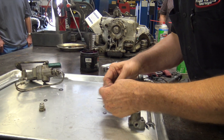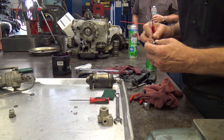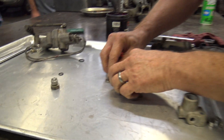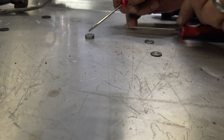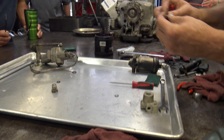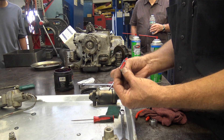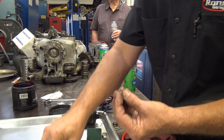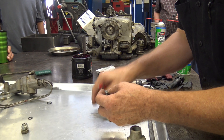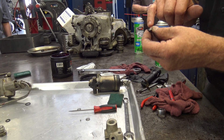You're supposed to hear this thing clicking. So let's try and clean it. The piston is shorter than the thickness of that housing. If you see, when it's on a flat surface and you put this little button in there, it's down below the shoulder — so it's made to walk back and forth. Does fluid pass around that? Yes, it goes right through that, so you definitely have to have clearance. Usually you can hear them tick, and it should just fall right through. Sometimes I take a tiny little file — I think I see something, I'll be right back.